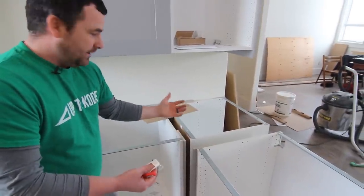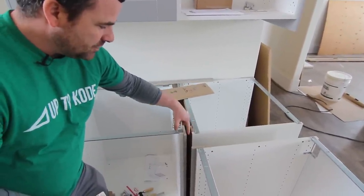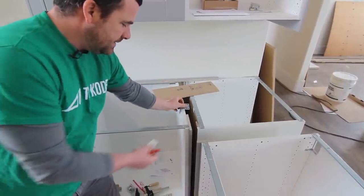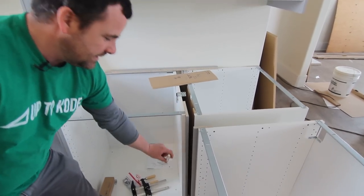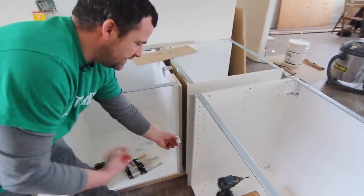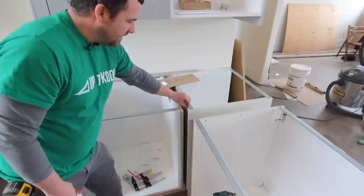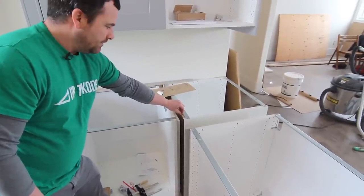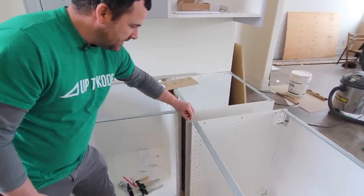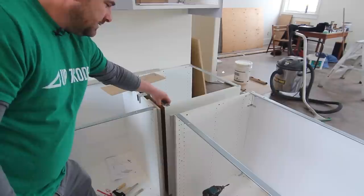To prepare for Plan A, this little bracket usually sits in the top corner and protrudes back for the rail system, so I took that off — same with the white nugget at the bottom for the rail system. When you start getting into islands and peninsulas, I modify the IKEA system. Basically, I take a three-eighths piece of plywood, put some L-brackets on the inside, and get it secure. That way this panel coming through here could be secured enough to be strong.